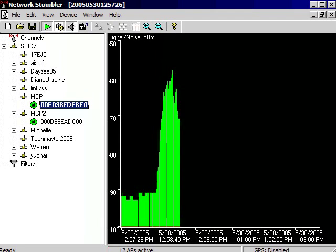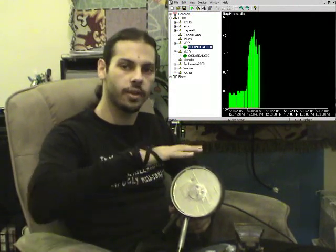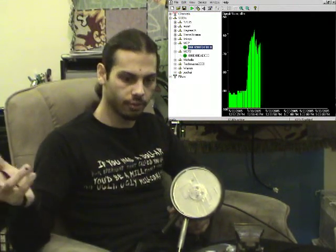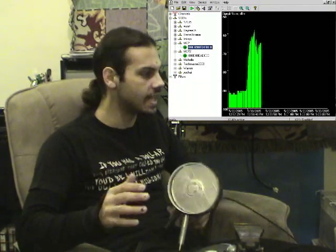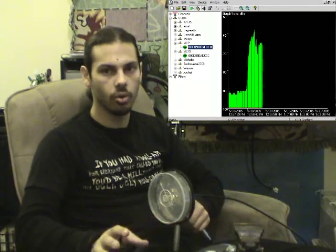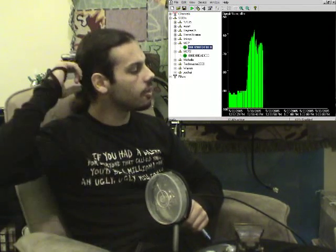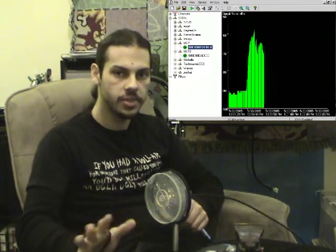Every 3 decibels. Now, I don't think I've explained decibels. And why is NetStumbler in the negatives? NetStumbler is measuring loss between your access point, free air, to your computer, or to your receiver. It's measured in negative decibel gain, meaning that's how many decibels you're losing. Ideally, 0 decibels means no loss whatsoever. So by having 0 decibels, which means you have 100% signal, you're losing nothing.